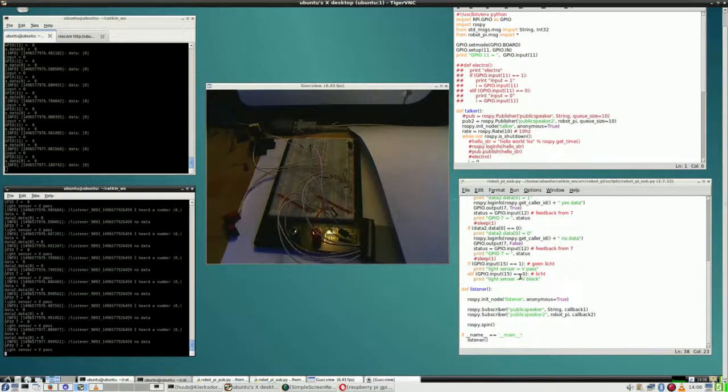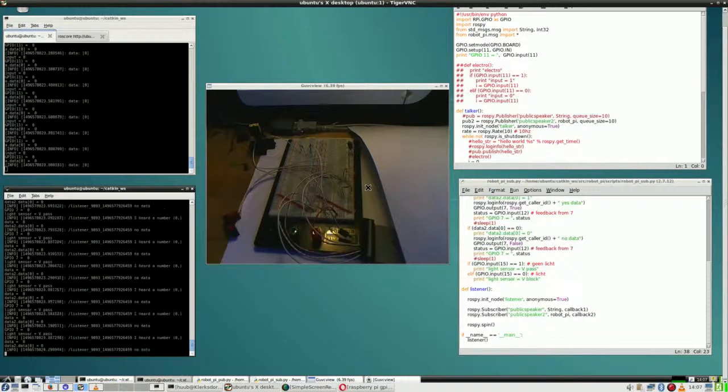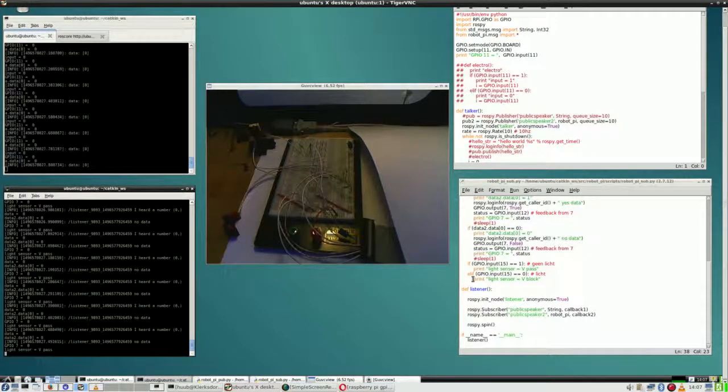that it is seen? However, I am worried about the voltage. Truly worried. Because the maximum voltage on the mains, for example from here, or simply put, the red lines, is 5 volts. And the common output and probably also the input is 3.3 volts. So, is it wise to use something that has been measured to be 4.5 volts to let it over the GPIO? That's a very big question, and I'd better find it out.